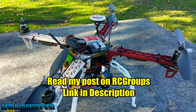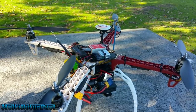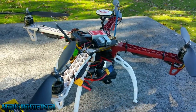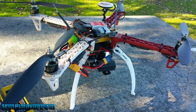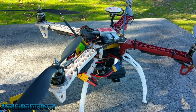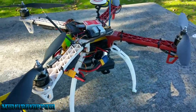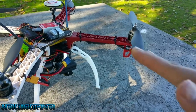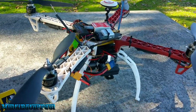4 grams per watt is pretty bad. A really good ratio to have is somewhere around 10 or even 11. RC Timer has the 2212 motors and props combo and they advertise an 11 grams per watt ratio — I'll put a link in the description; those are the motors and props I really want to get. So for example, if you have a 10 gram per watt ratio, your quad will lift 10 grams for every one watt you give it. Give it 100 watts and it'll lift 1,000 grams. It's not linear though — the power draw is kind of curved depending on the type of props, the way you fly, the weight, and the efficiency of the props.